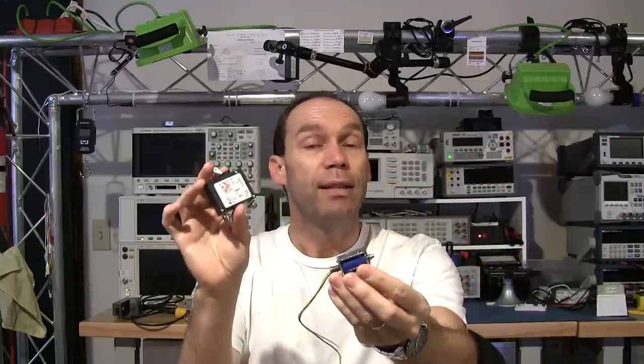Hello YouTubers and welcome to part two of how a trip breaker or circuit breaker works. In part two we're going to look at the instantaneous break. I'm going to demonstrate how a solenoid acts to activate the instantaneous trip, take measurements on an oscilloscope, and see if we can get any correlation with the voltage, current, or energy applied to activate an instantaneous trip — for both DC and AC.